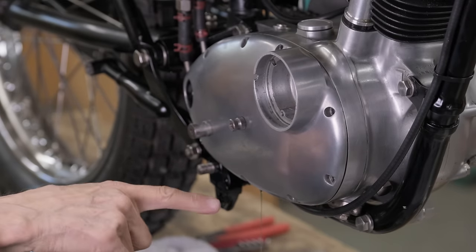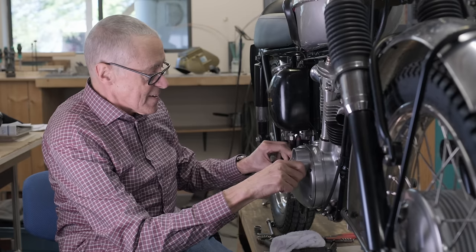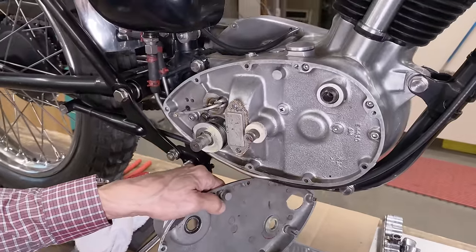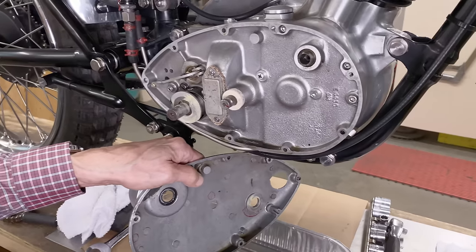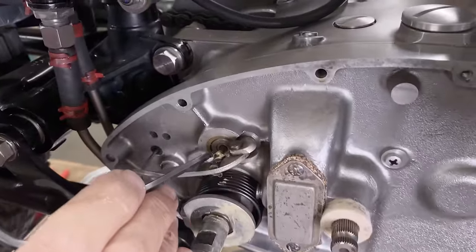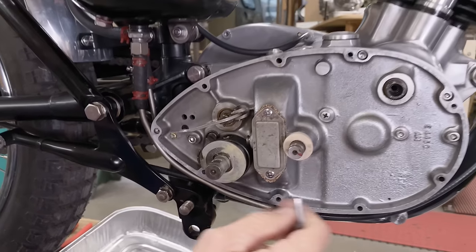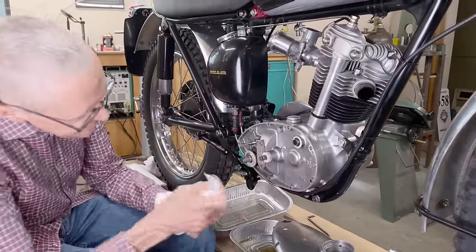See the oil coming out of there? There was a level of oil in there — there's not supposed to be oil in there. It's seeping and weeping. There's not supposed to be oil in this. If I clean this off, maybe we can see where it's coming from. It's possible the oil could be leaking out of the shaft here, because that's a shaft in a bronze bushing with no seal. I think the level is supposed to be lower, but if it fills up here it's going to keep on leaking — there's a quarter inch or more of oil in the bottom.